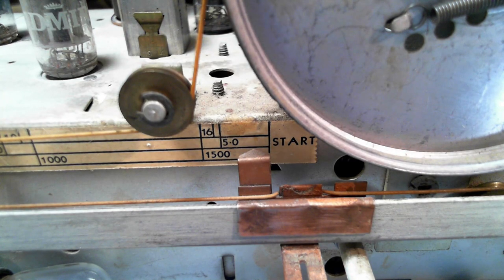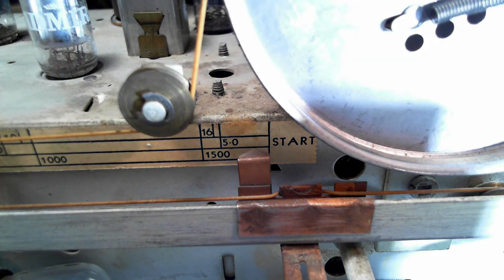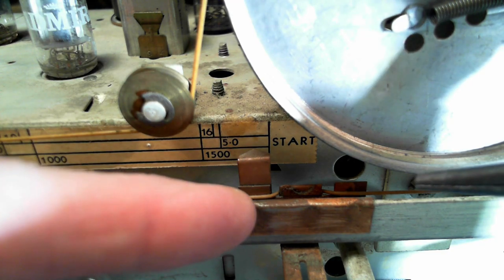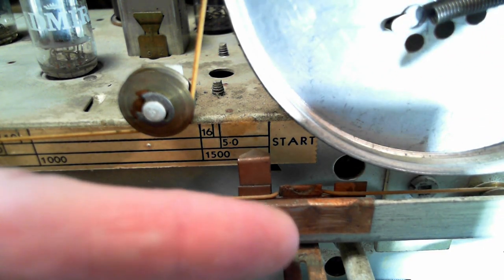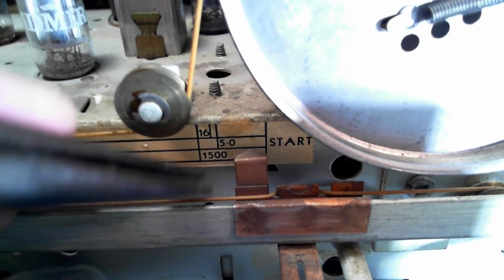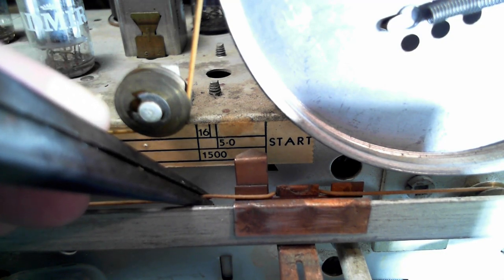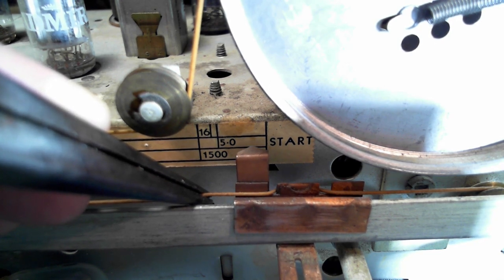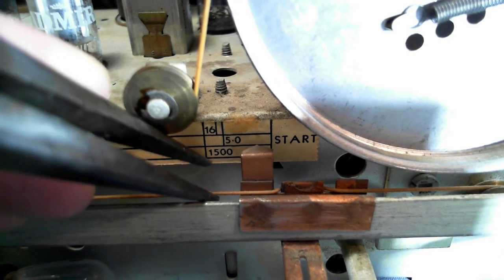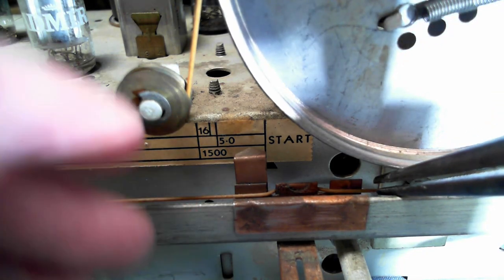So to move it, first take a look at the string. Did anybody glue it? No, it's not glued. That's good. Now I'm going to show you a little trick here. I learned the hard way. You can learn it the easy way. It would be natural, if you want to move this slider this way, I'm pointing, on the string, to think you need to grab the string up here and hold it so nothing moves but the carriage. But in fact, this won't work well. You're going to be into big trouble holding it up here because it's going to tighten its grip as you go to move it. You actually hold it on the other end.